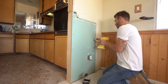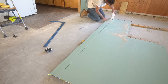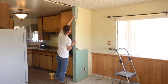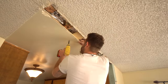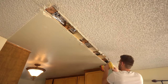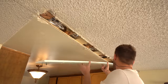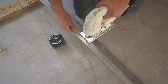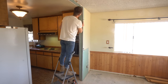I'm using inch-and-a-half drywall screws — I'll leave links to everything I used down in the description. I cut my other pieces the same way, and if you're not comfortable with these long cuts, you can use a board as a straight edge guide, that way you get good clean cuts. I also added more plywood backing behind the drywall between the ceiling joists — I just wanted to make sure everything lined up really nice and didn't crack over time. If you're doing this as a one-person operation, it's convenient to start a few screws in your drywall, that way you can just hold your drywall in place and secure it down. These right-angle metal pieces are called corner bead, and after I cut them to length, I installed them on the wall using inch-and-a-half drywall nails.